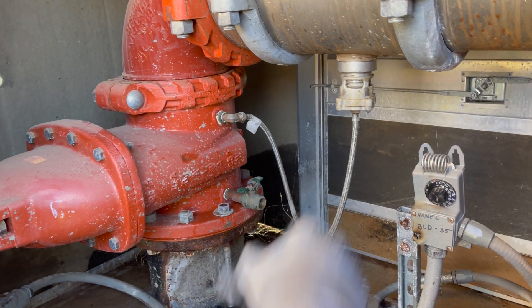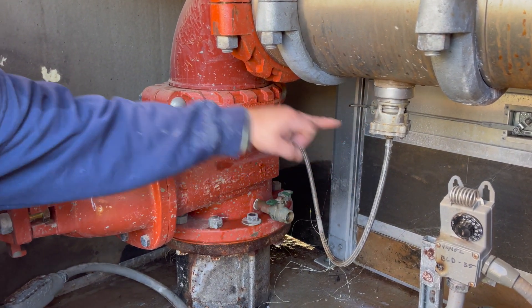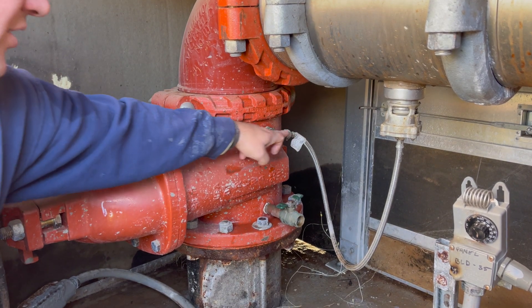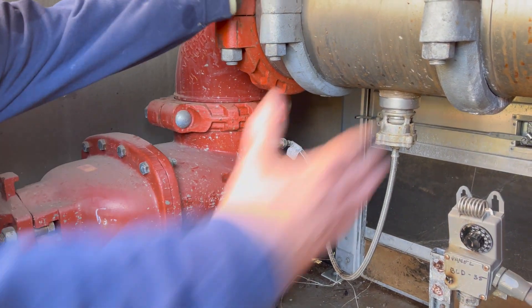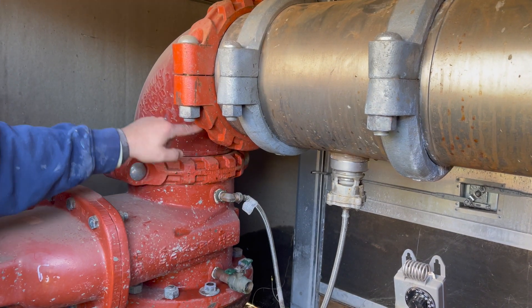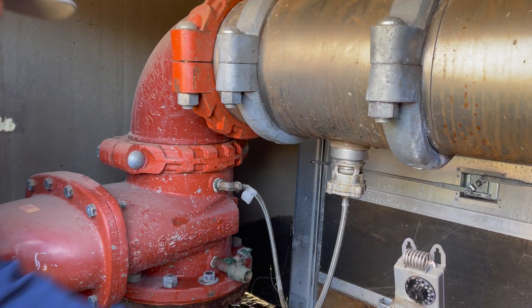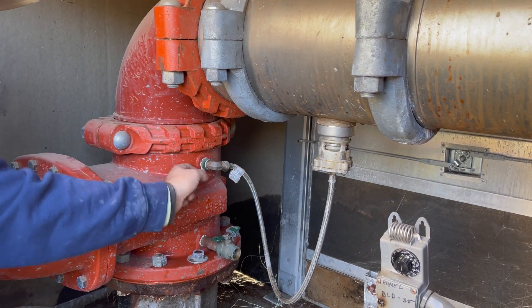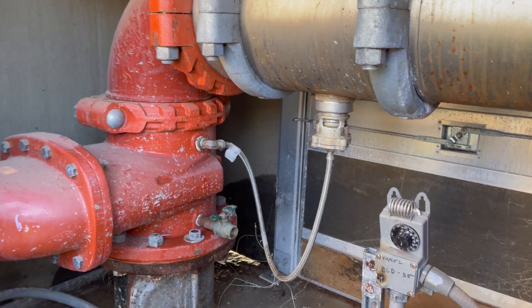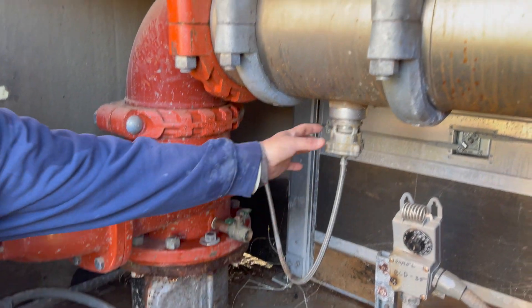Some of the sensing line thing — what does that actually do? I believe after 4-inch, most of the time they're going to go to the sensing line for the relief valve instead of having just a relief valve dump, because it's going to have so much pressure. So they have a sensing line — this is pretty much a relief line. Any extra pressure in between the number one and number two check will be sensed and let out, because there's a little channel in the zone between here to let it come out. It pressures up against it and then any extra pressure, it dumps out. When we turned it back on there's a spring that had this down, but it went up and sealed off there.